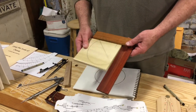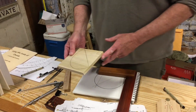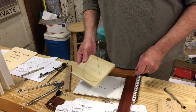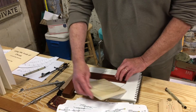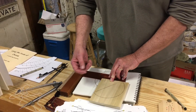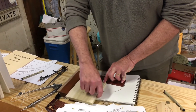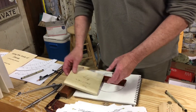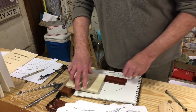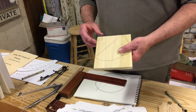Because you have to have something to reference to. With just a saw you're not going to get it perfectly square, but if you lay this on a flat straight piece of wood — a straightedge — and scribe a line, then flip it and scribe a parallel line, if those lines are close together you can take a plane and tune this to within about a thousandth of an inch of being truly square.